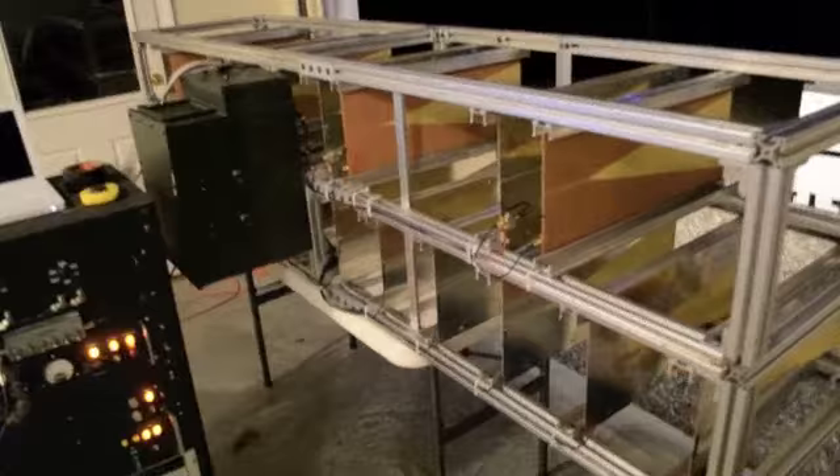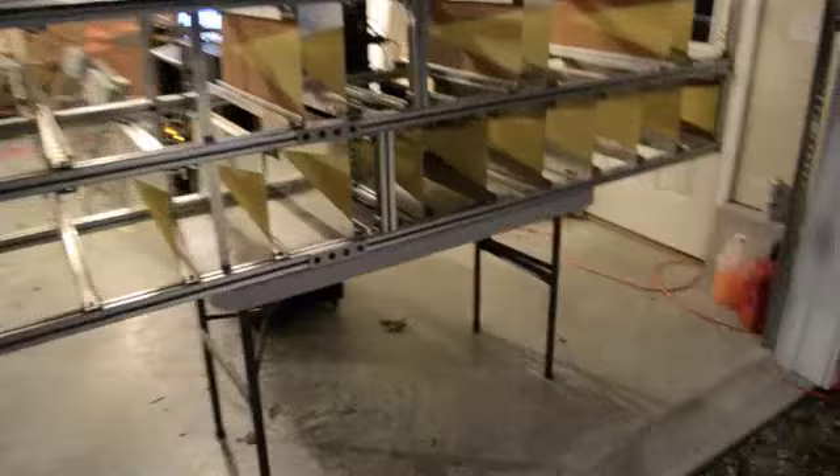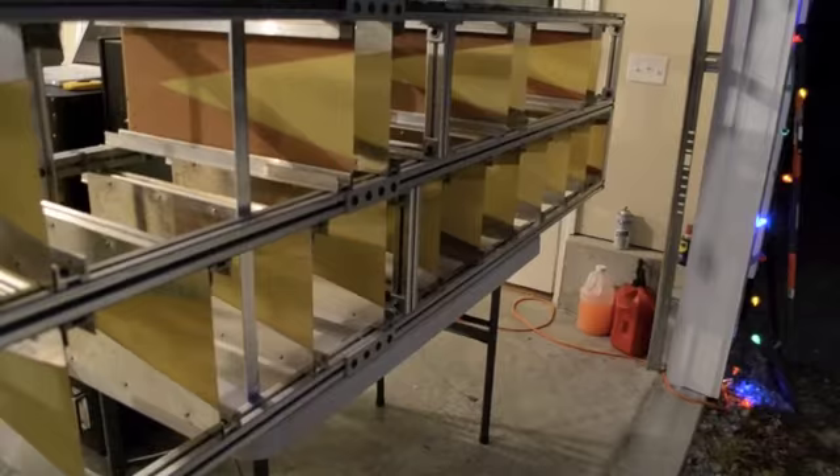This big green box here is where all the antenna controls are located. Coming around the front, you can see the receive element. The bottom row here are the transmit elements — there are 13 of those. The top row are the receive elements. If we zoom in to the receive element, you can see that there is a low noise amplifier on each receive element to preserve the noise figure.